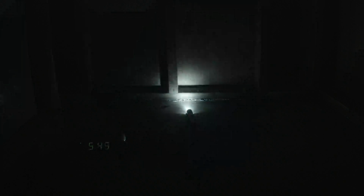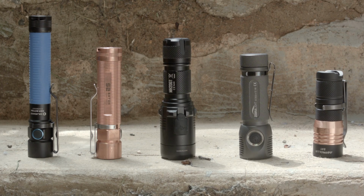Then is medium mode. Medium runs solidly at about 140 lumens that I measured for nearly 5.5 hours. This is a nice, long, usable runtime with a moderate amount of light. Remember, this is on Eneloops. But the light starts flickering at about 5.5 hours and you get low frequency PWM emergency light. Remember, I called it emergency, not Olight. Until about 8 hours. And just so you know, using lithium primaries like I talked about earlier yields even longer run times. Now it's Beamshot time, bros.